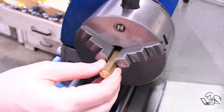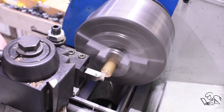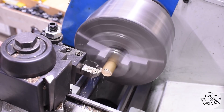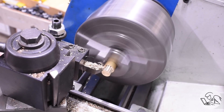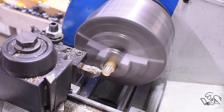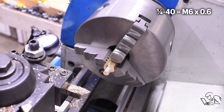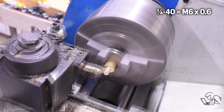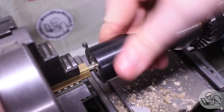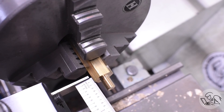We need plugs to go in these bushings for hydrostatic testing in the future, and these plugs will also be useful when silver soldering. We need four of them and luckily all four are identical. I'm turning down some hex bar stock to the diameter of the threads in the center, which is 1/4-40 for the front bushings. I'm sneaking up on the dimension and noting the cross slide hand wheel, then cutting the threads.